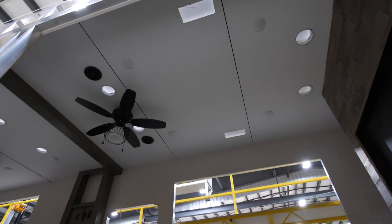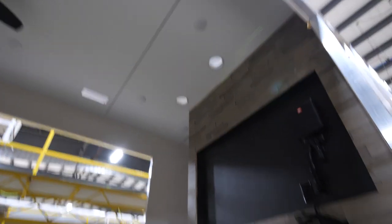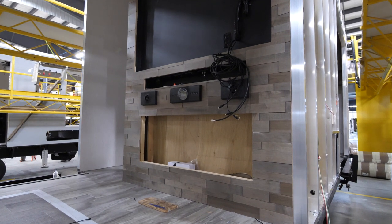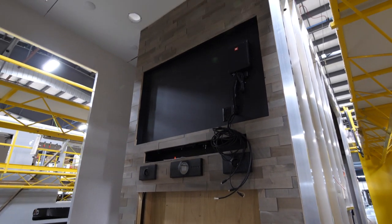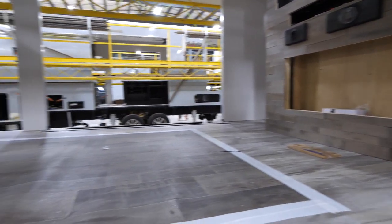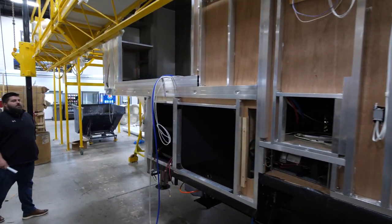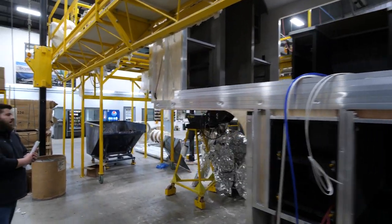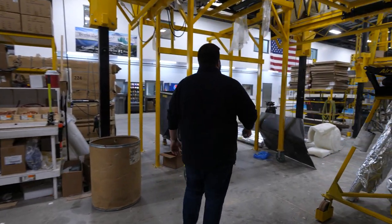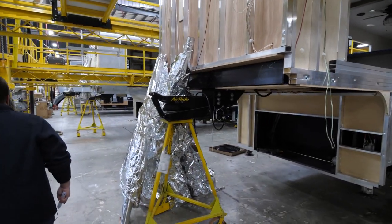Inside the unit is starting to look like a unit. You've got most of your electrical done — we wait to do TVs, fireplaces, and a few items so we go a little further down the line; the actual wiring's done but we don't want to risk damaging them. It's got ceiling fans, lights, and all your outlets are done. It's getting ready to get the roof insulated with fiberglass insulation and R38 radiant foil wrapped all the way down the front and back in one piece.